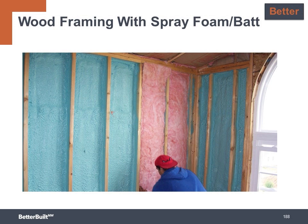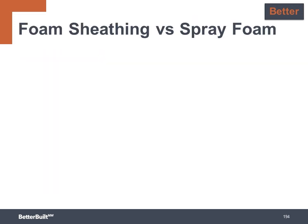A thin layer of spray foam goes in against the sheathing, followed by a fiberglass bat to make up the remainder. Although this makes for a higher R value and great air sealing, it does not eliminate the thermal bridging of the studs, so the overall wall performance still takes a hit from that conductive heat loss.